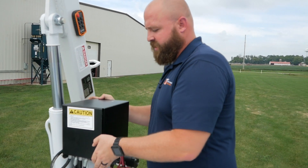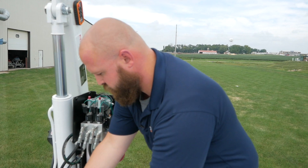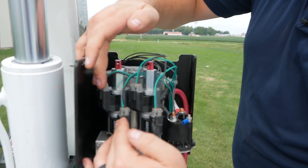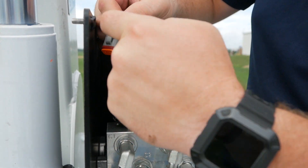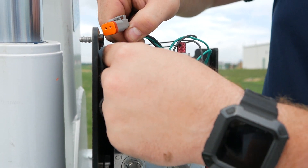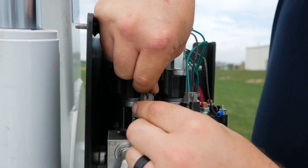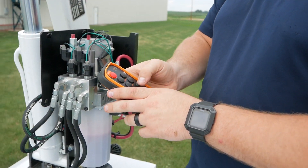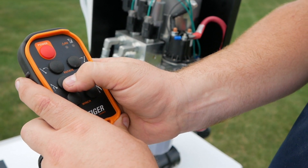At that point in time you can lift this cover straight up. These two coils here — you're going to switch the Deutsch connectors. Take this one, put this one here, this one down here. With your crane remote, you're going to press the lift up function, which should make the crane go down.